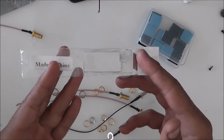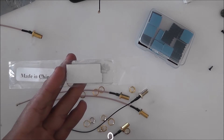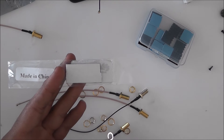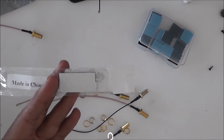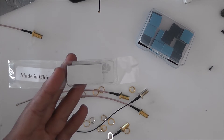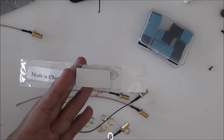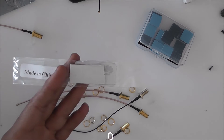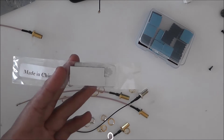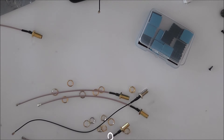I also have a thermal pad here. What I would like to do is put this thermal pad in between the LoRa concentrator and the Power IC shield, because the LoRa chip does get warm-ish — hence there being a heat shield on there already. But I'd like to try and transfer that heat away from it as much as I can, because I don't want the card to throttle. So those are the upgrades — we're going to put them together now.